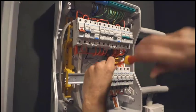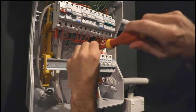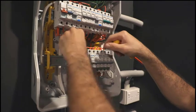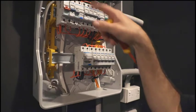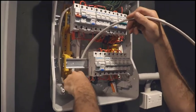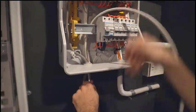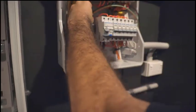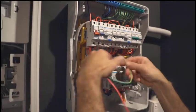So from the RCD here, what we're doing is basically just taking off the existing normal grid supply, both active and neutral. And then we add in a circuit or a supply which is going to come back from the Protect-Plus for the non-normal loads or for the essential stroke backup loads. So to reiterate, we have the grid supply going to the Protect-Plus, returning from the Protect-Plus are now two circuits, one for normal loads and one for backup loads.